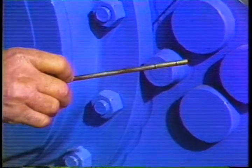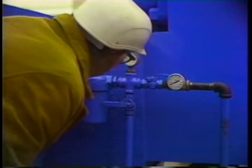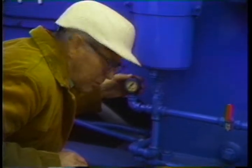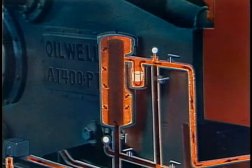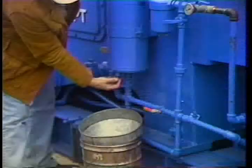Your oil level checks out, so start the pump back up. While the pump is operating, look at the oil pressure gauges at the filters. If the pressure at the inlet to the filters has increased to 15 pounds per square inch above the pressure at the filter outlet, this indicates the oil isn't flowing well through the filter. Most likely the filter element's dirty, so change it. You can change the element in this cartridge type filter while the pump is operating if you need to. There are valves provided to let you bypass the oil filters while you're working on them. Remember to route the lubricant back through the filters once you're finished.